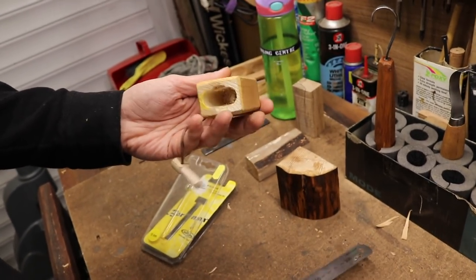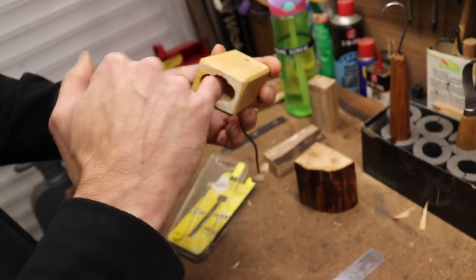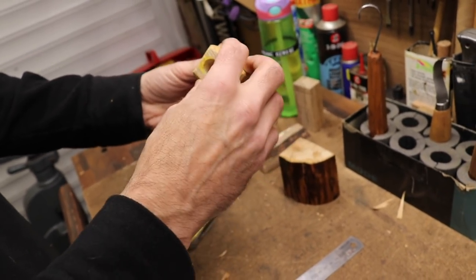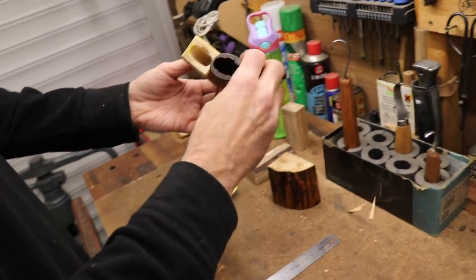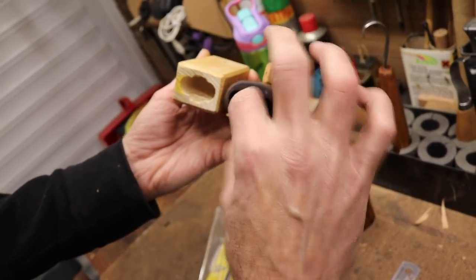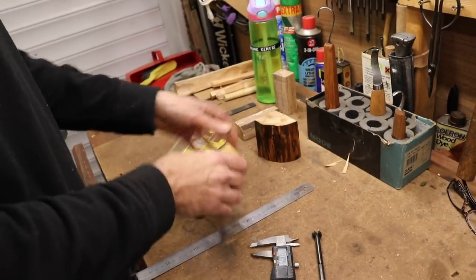Then same sort of thing at the end, 5 to 10mm extra meat in the end of the box, so that basically we've got a 5 to 10mm wall around the blade, and it makes a reasonably strong box. You could go thinner, but it's likely to have weakness. See, look, if you look at this, it's the same dimensions, but all I've actually done is just taken the corners off. So there's still that thickness where it counts. Now we've established that, we can make this.